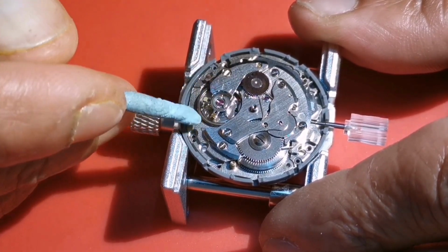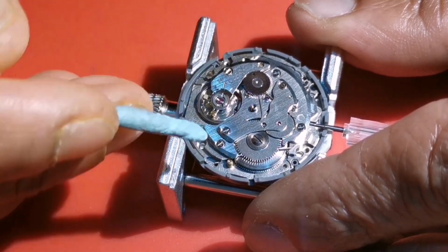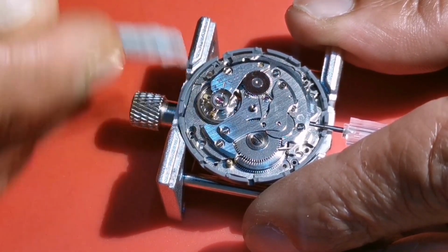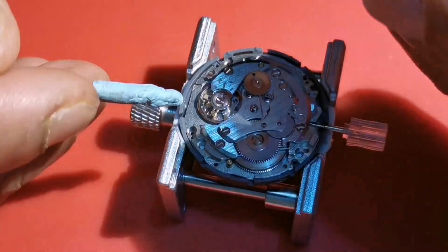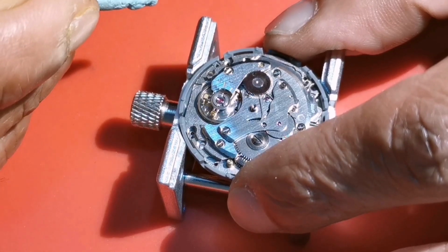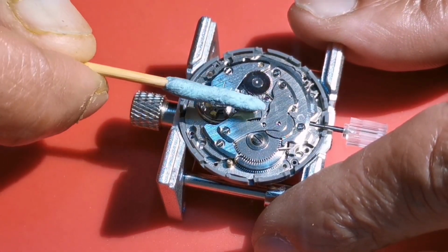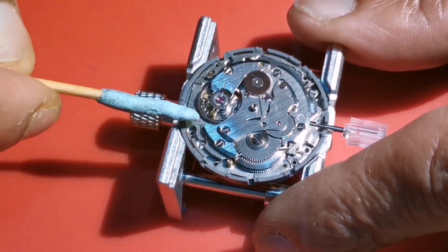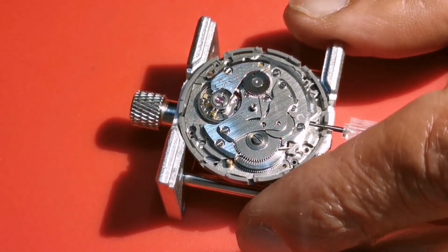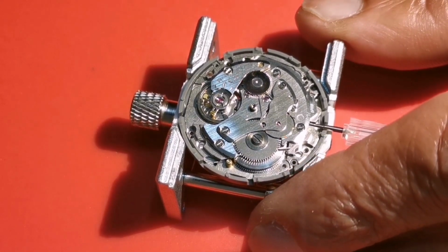The balance is not swinging. It is swinging, I mean, it's not catching the pallet fork, so obviously it's not ticking the watch. So the pallet fork is not going up and down or left right, you know what I mean. So it's not ticking, and if the pallet fork is not moving, the escape wheel is not obviously moving, and if the escape wheel is not moving, means the clockwork is not working. So now you can see that it's free, but it's not working. So I'll take this off,